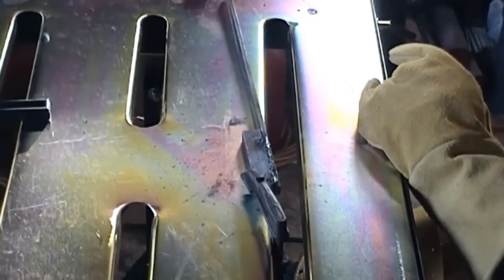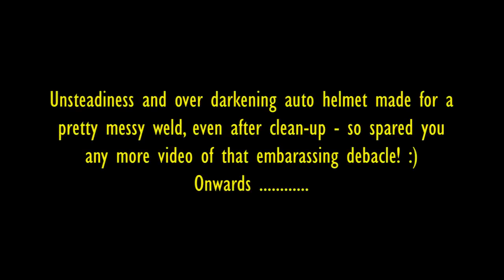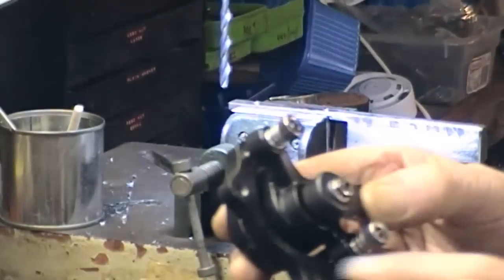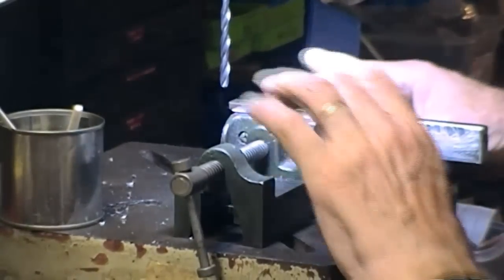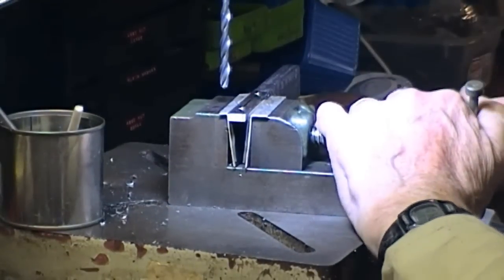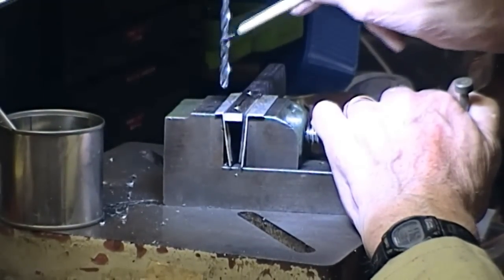Let's see what I was doing there. Let's clean that up. I'm making a pair of holes now for the caliper mounting holes. They're two inches apart, so I've just center drilled into the half by three-sixteenths and I'm going to put slightly oversized holes in that.